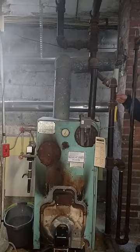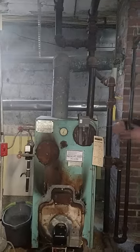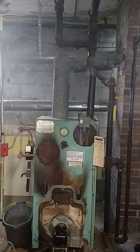Now I'm not adding it fast here because the boiler's been running. And if you put all that cold water into that boiler too fast, again, you could crack it.